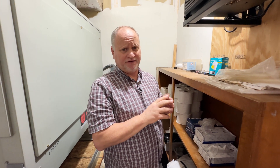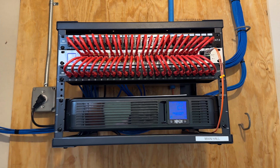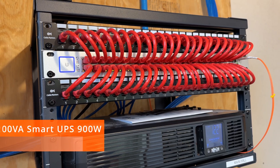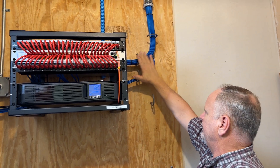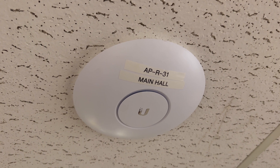Let's go to the red switch — it looks just like the yellow switch, same rack, same 48-port PoE switch, same red jumpers, TripLite UPS backup. Got the blue flex conduit coming in with fiber from the yellow switch, Cat6 going out distributed to the computer lab and all the phones on this wing, plus some APs. It also takes care of our microwaves that go to other campuses — those are up in the steeple of this building.